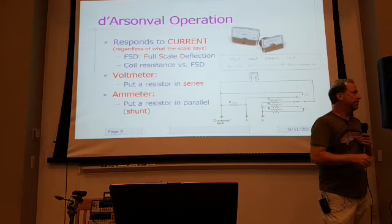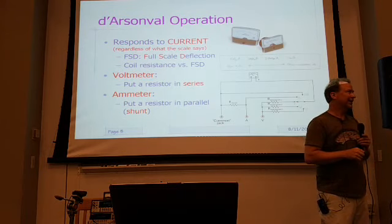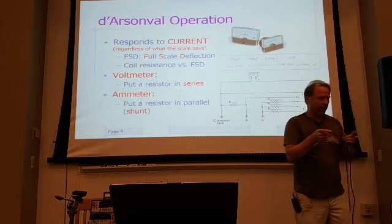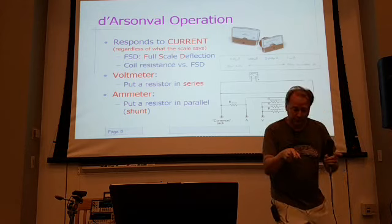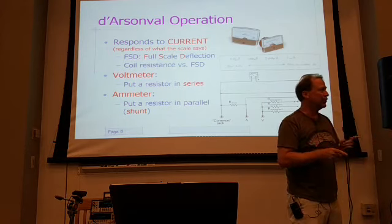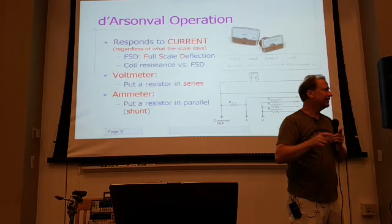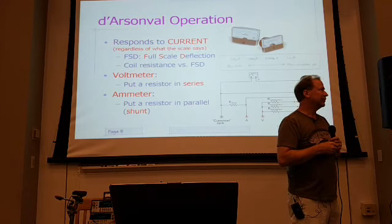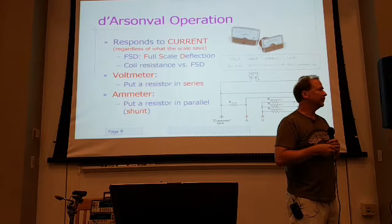The ohms per volt phrase is misleading. It's a constant, it doesn't vary. If I'm measuring 1.5 volts or I'm measuring 2 volts, if you're on the same scale, it's still the same resistance. The resistance doesn't change depending on the voltage that you're measuring. So you're right, it is misleading. What's not constant is the perturbation to the item you're measuring. It will distort your measurement at the low voltage scale. Because the ohms per volt may be constant, but the overall impedance the meter presents to the circuit under test will be more perturbing on the low scale than the high scale.